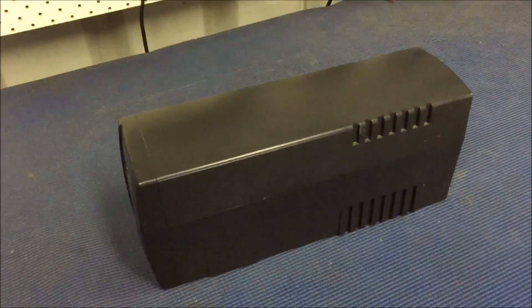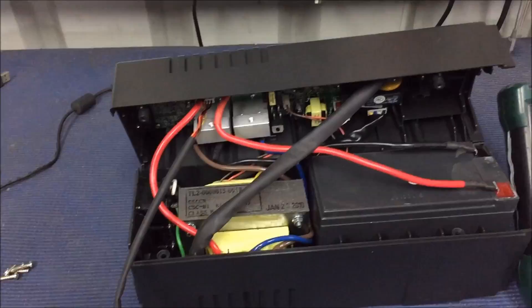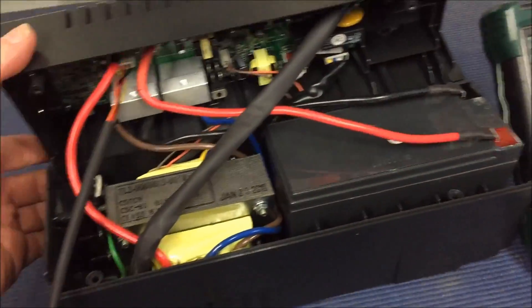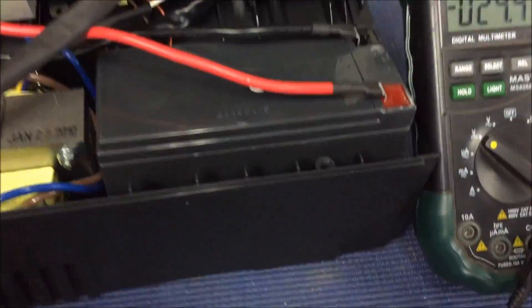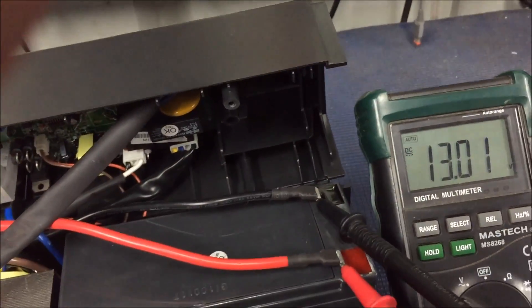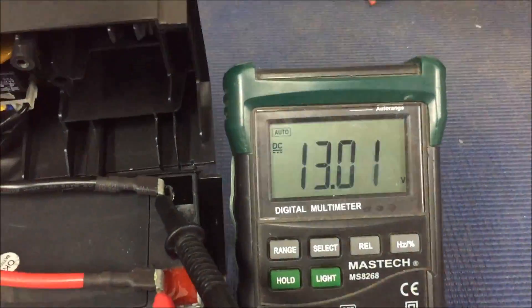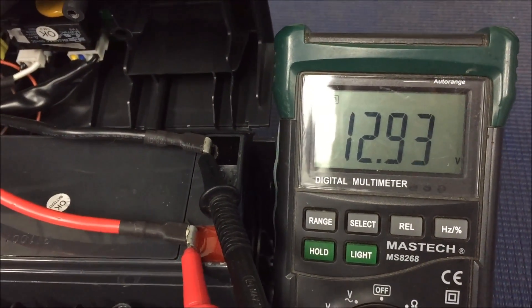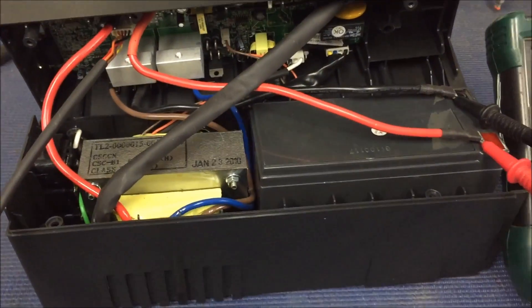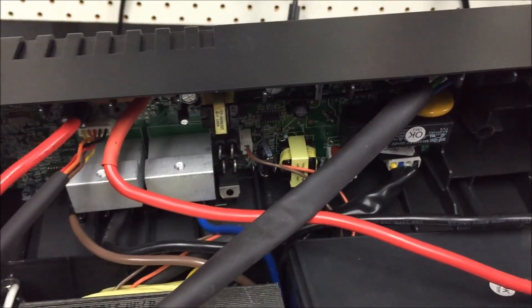Okay, so we got it open - there's only six screws holding it shut, nice and easy. The front came off. The battery's there and still in pretty good condition, actually still got good charge. 13.4 volts. Turn it on - it beeps, the voltage drops straight down, so it all still works. I just stopped using it because it was too small.